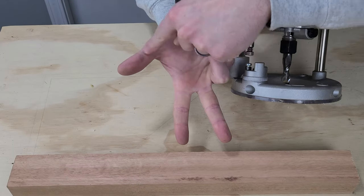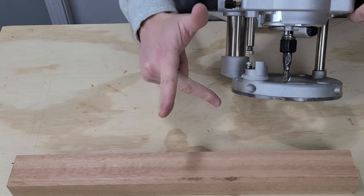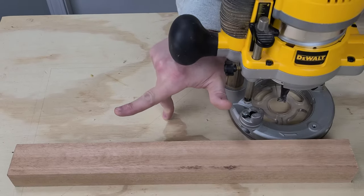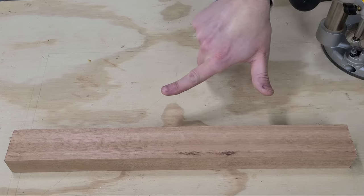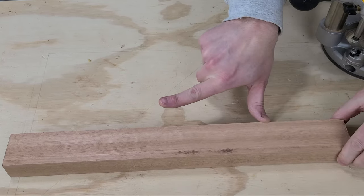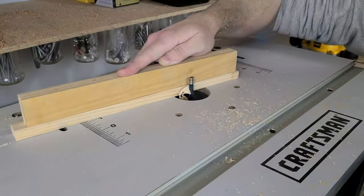To cut safely, it is better to resist the motion and move your router in the opposite direction it wants to pull. The easiest way to determine this direction is with a right-hand rule: hold your three fingers with your palm as the base of the router and your middle finger as the router bit. Touch your thumb to the edge of the workpiece you want to cut, and your index finger will point in the direction you need to go. This works whether you are on the outside or inside of the piece, holding the router by hand, or using a router table.